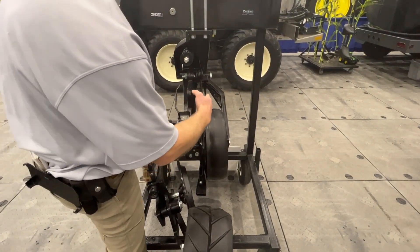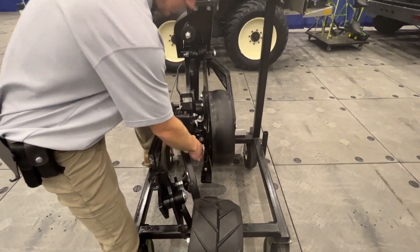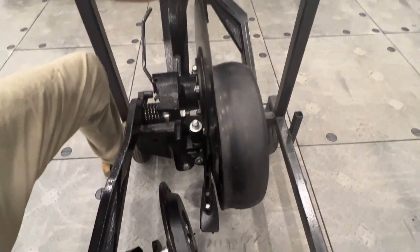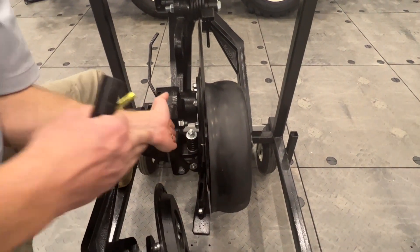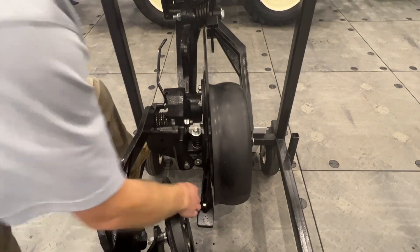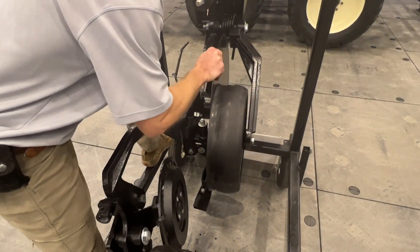This 22-inch blade — you can see the secret is that it's on a slight angle. What that angle does is it creates a path for this knife and beaver tail to shoot that anhydrous down. The leading edge is hugging to the left, which opens up a slot for this knife to slide down in there. The width of the slot we're putting in there is roughly an inch and three-quarters. This beaver tail runs below the ground — that's the secret. This blade is just going to spin and slide right through the dirt.